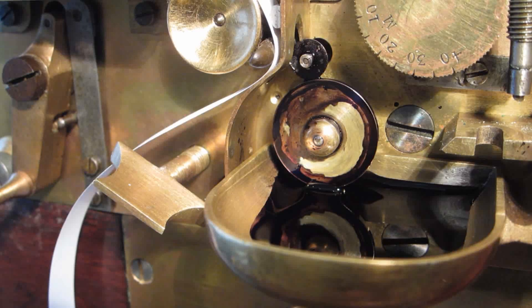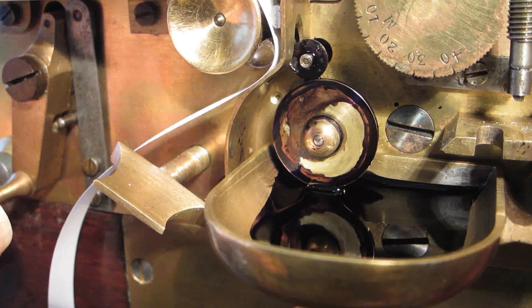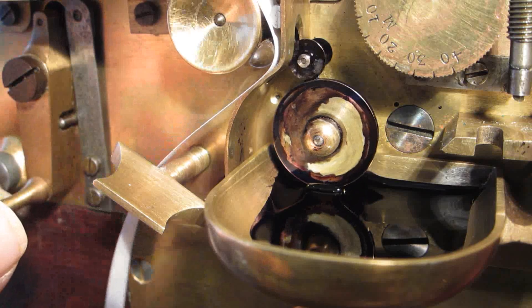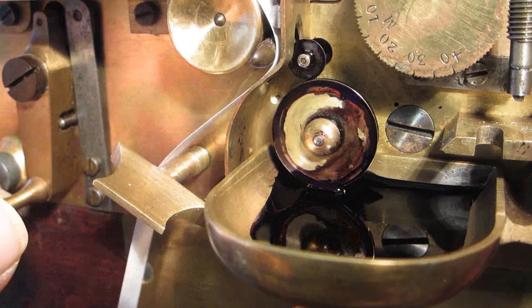But first I'll demonstrate the inking mechanism at only 100 letters per minute. The little wheel has to be all but touching the big wheel, as you can see their edges are going in opposite directions. Watch how the little wheel pushes up a wave in front of it and skims the ink off the big wheel by surface tension. Only a professor of physics could have thought of that.